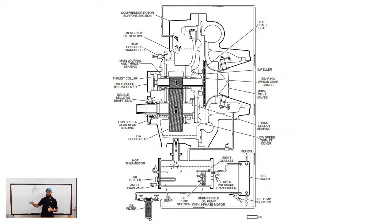speed that compressor up. So earlier I said, and somebody may have mentioned it in the comments, on the Trane's RPM, I think they're 3,600 RPM for Trane. A York and Daikin Turbocor will run, or even Carrier, I think Carrier's in the same ballpark in terms of RPM. Anyway, you're talking on the low end around 15 to 20,000 RPM, and then on the high end as much as 30,000 RPM, or maybe even a little more in some cases, depending on the specific series.